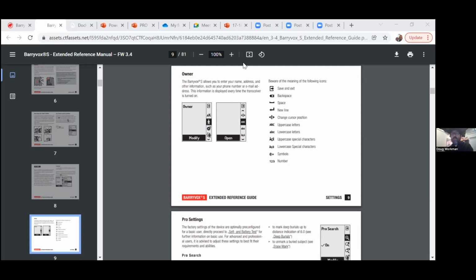In instances where you don't have confidence, in pro settings, you also have a pro check mode where you verify the accuracy of the 457. You verify the timing of the on of the beep and the off, because those are regulated by all manufacturers. There's an allowable milliseconds for the duration of the beep and the duration of the silence. And you can check all of those functions.